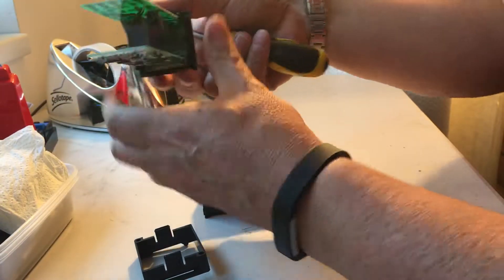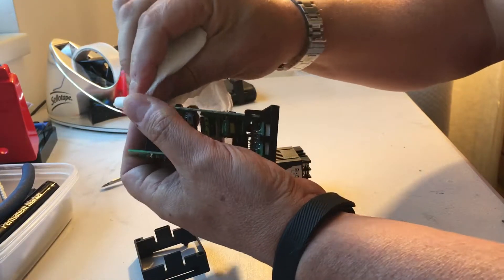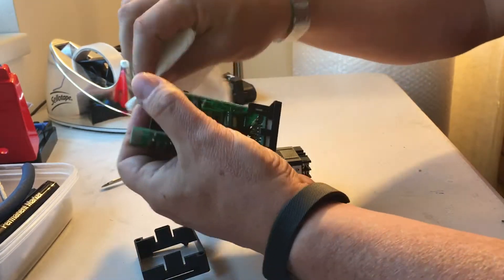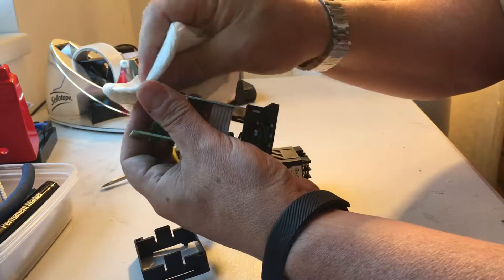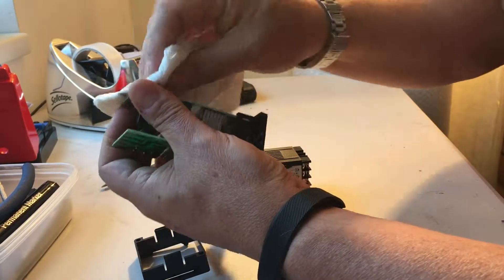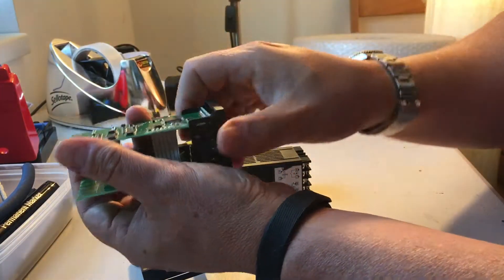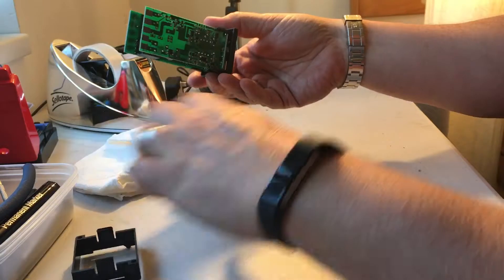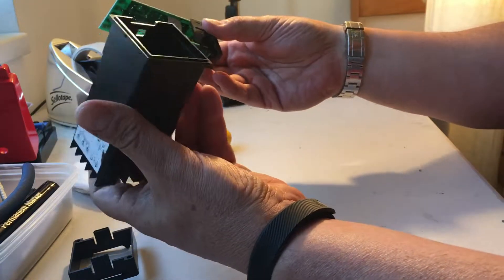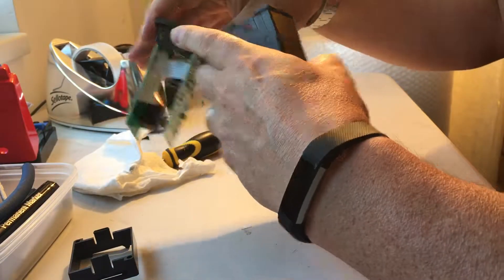The best thing to do is with a dry cloth or paper towel, gently rub the PCB connections on the top, then turn it over and rub the connections on the bottom as well, just to remove any elements of corrosion, oil, grease, or anything else that may be present.